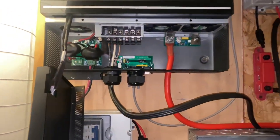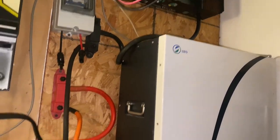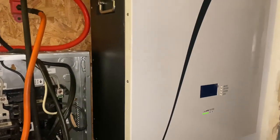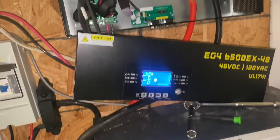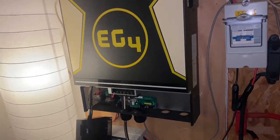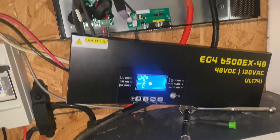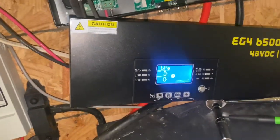The only thing I had different on there was the bypass mode - I left it on so it could charge the batteries because these batteries were low. I'm gonna hook this new one up by itself to these batteries and cut it on and see if it trips that alarm. I'm back - the inverter cut on, so now that lets me know something's going on with the old inverter because the battery's not alarming anymore and it's working.